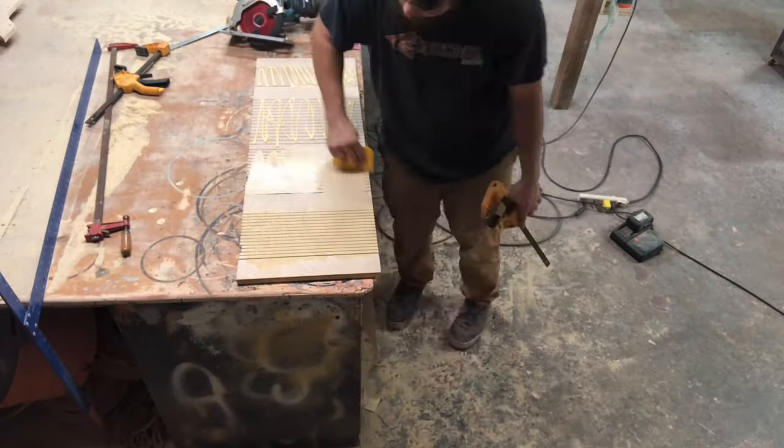So on a normal enclosure, this would obviously be a lot easier, but with this, I want to be able to show you guys the open face of my KERF and show you guys how it looks. So other than that, really all you're going to do is give it probably an hour and a half to dry up. That'll make it dry enough to be able to work with if you're building an enclosure. If you're gonna make something standalone that is KERFed, I'd probably recommend waiting the 24 hour mark, 12 hour mark at least, to start taking it off the clamps.